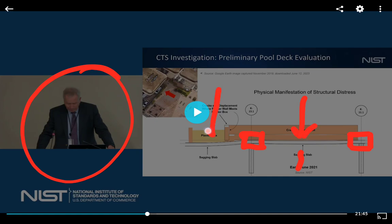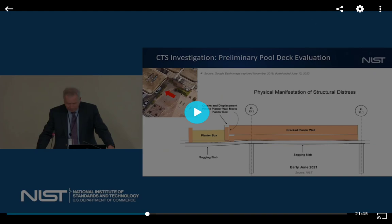If you look at the top of the deck and follow it over to the left to where I stopped by luck — that thin line is where the top of the deck was supposed to be. If you look at the bottom line there's two lines out here. The bottom line represents the bottom of the deck, and as you see the deflection in this rendering by these people who got 23 million dollars, it practically shows that the deck on that date is below where it should be — it's dropped at least eight to nine and a half inches.